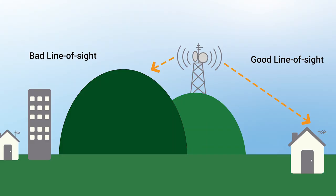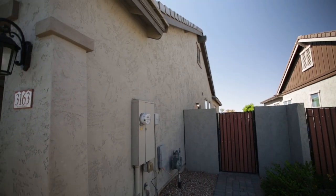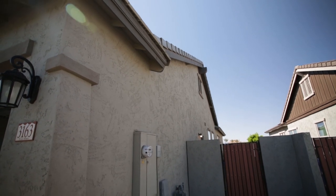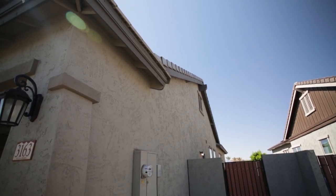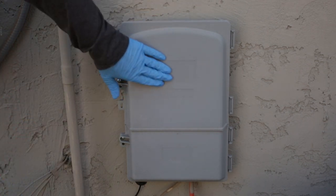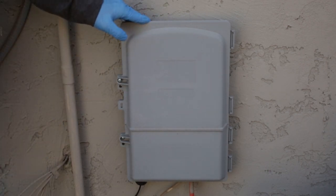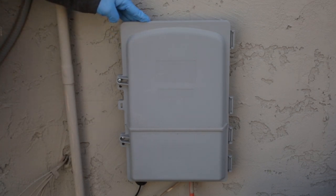Next, go outside and identify all possible obstructions such as buildings or tall trees that could be impeding line of sight between the broadcast towers and your home. Also, look out for locations or surfaces on the roof or around the house that are not ideal for mounting the antenna. Lastly, for homes that are already hardwired with coaxial cable from a previous cable or satellite installation, you'll want to locate the point where the existing coax enters the home. This is where the cable from the antenna will connect into the home. Mounting the antenna within close proximity to this location is ideal and will save you a significant amount of time and effort during the installation process.